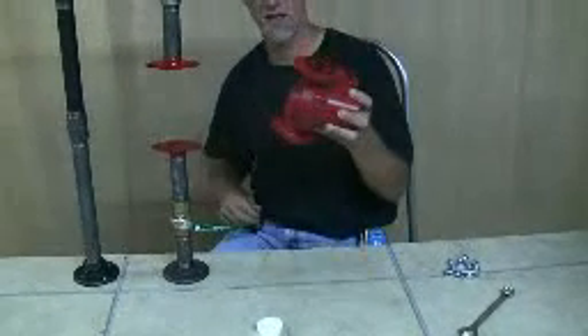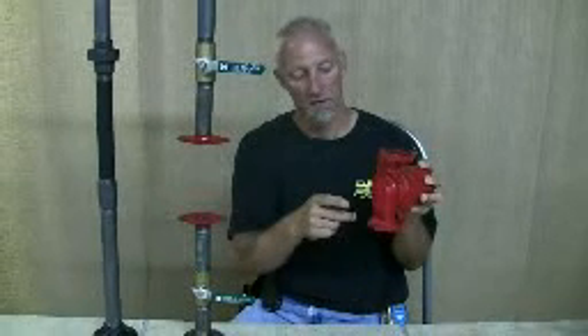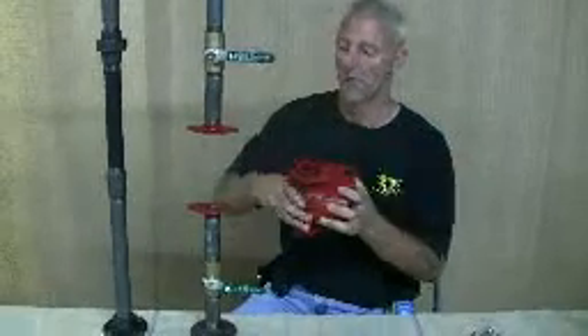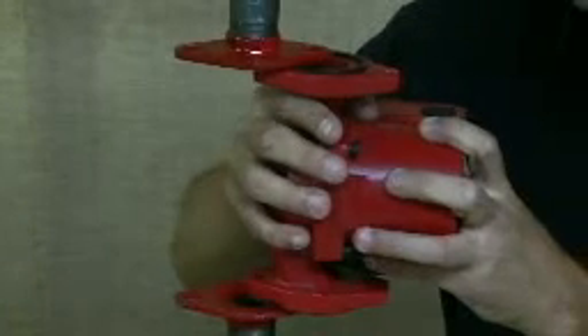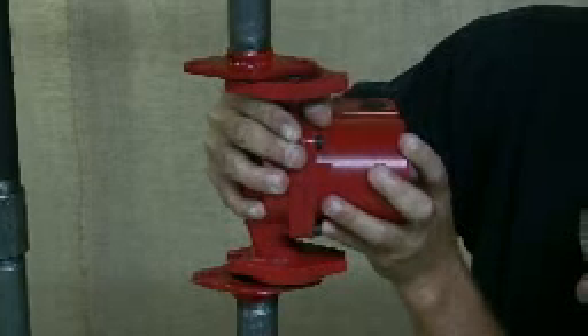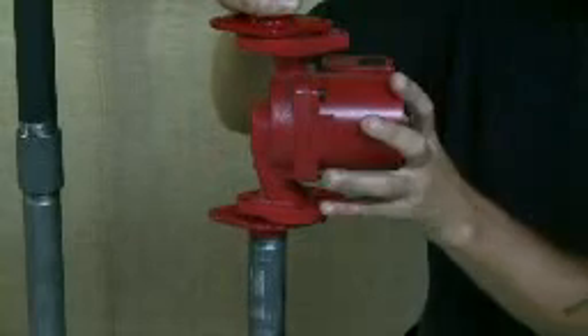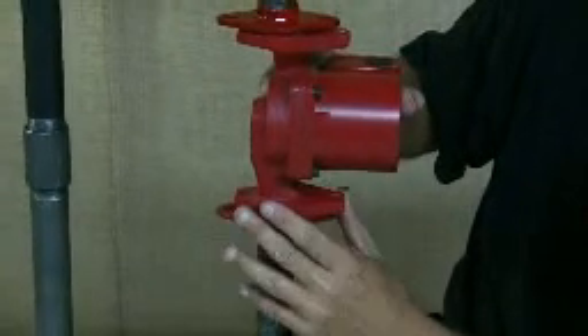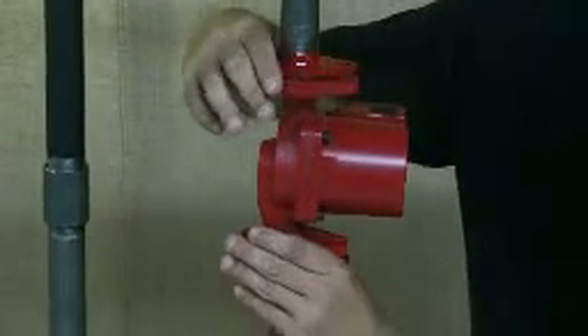Make sure you put the pump back in exactly the way you took it out. If you plan on changing the pump body in any different direction, make sure you check your flow arrow and make sure you put it to the correct flow. So now we'll set it in place down at the bottom and lift up a little bit on the top pipe. Try to get that flange gasket to get in there and slide, then try to evenly slide it between the flanges, taking your time — the soap will help you. Keep checking your flange gaskets to make sure you're not kinking them or folding them over, and make sure they stay in the grooves.